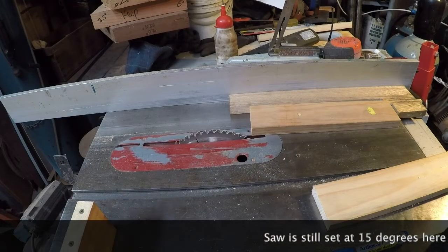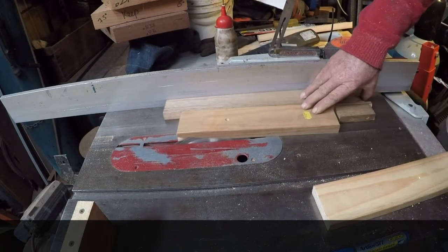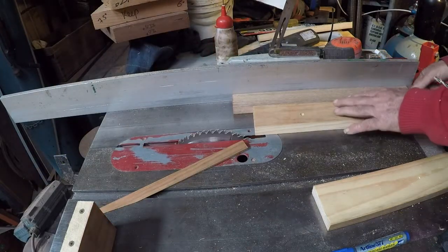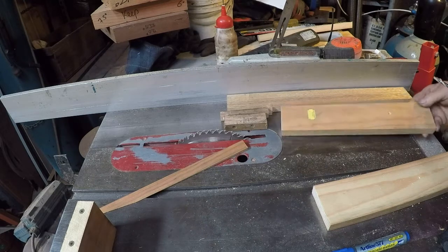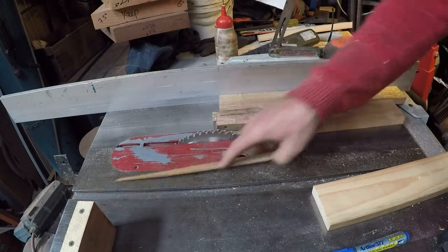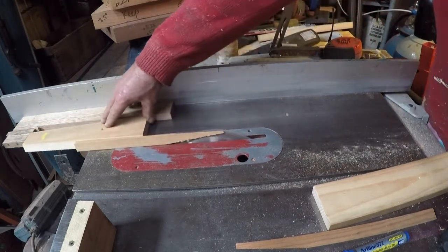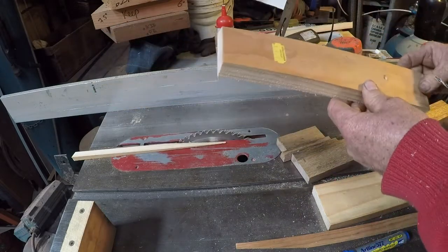First cut on the first step. Second cut is done by flipping the jig over first, flipping the timber over, and flip the timber over again. And then that'll fit nicely on that stepped point. Do the second cut. It's a bit narrow on my timber there. I'm gonna just adjust.